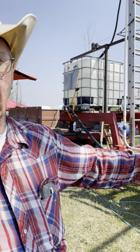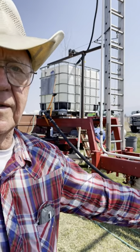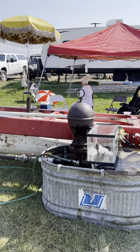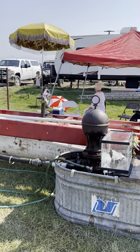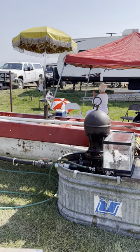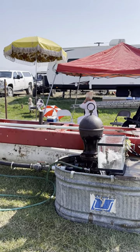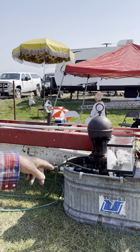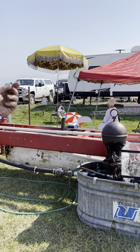The water pressure builds up and the water is diverted into that dome. The water comes down and out over here — and when the water gets going fast enough, it closes that valve. There's a shock of the water coming down; it needs to go somewhere, so it's diverted up into that dome. Then everything stops, the valve opens, water flows through, slams shut, and water is diverted into the dome again.